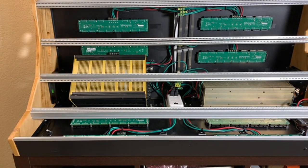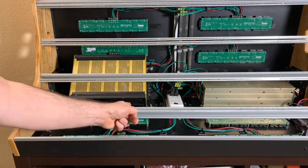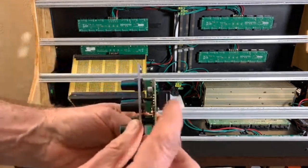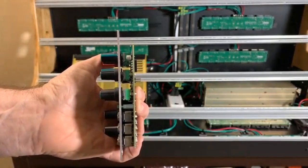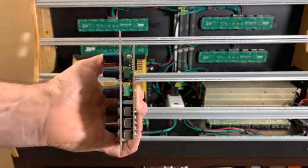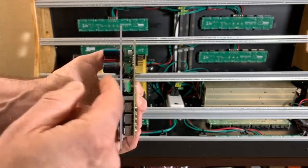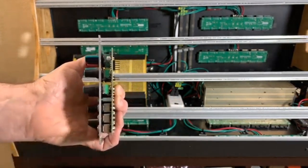But I'll warn you on Modular Grid, just don't trust anyone's module depth numbers on Modular Grid, because some people measure from the very front of the knob on the module to the back of the module. Some do it from the panel to the back of the module. Almost no one takes into account the power connector, the height of the power supply connector. From the knobs is a really special one. I guess it kind of makes sense to go from the height of the knob or the largest switch to the back, as you're holding it, but that's not useful at all, really. Yeah, maybe a separate measurement for case depth. Yeah. But whenever I do my videos, I do my own measurements from the back of the panel.